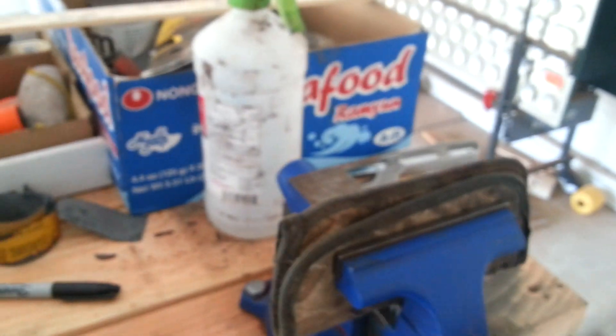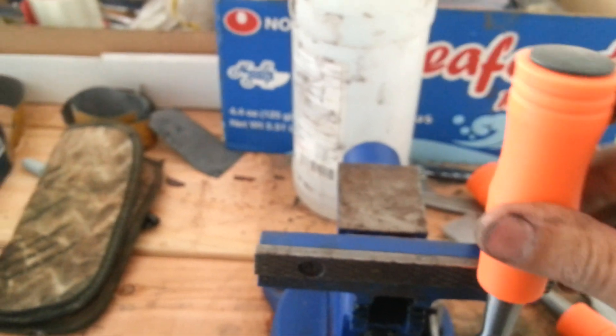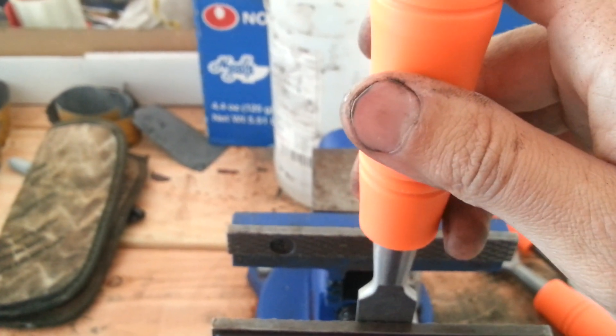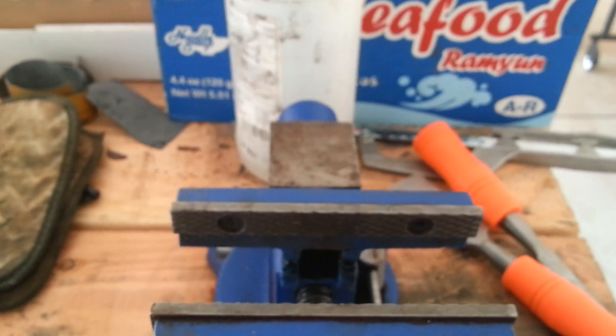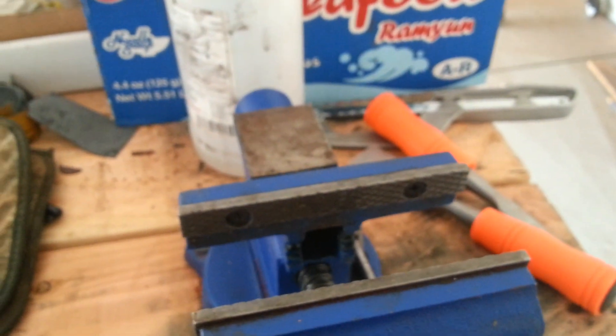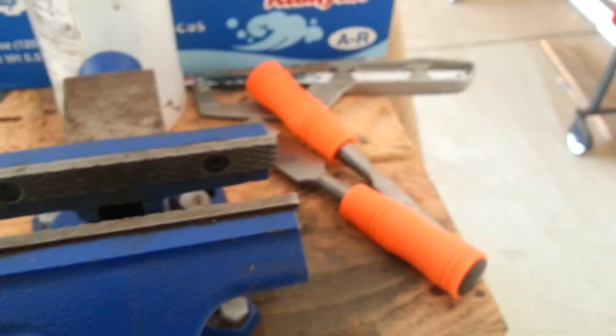So here's my bench vise. What you do is use three dowels — one here, one here, and one here. Just your bench vise, and you run your blade through it. Based on where you suspect the bend to be — let's say you have a bend like this — you place one dowel on each side and one on the opposite side to counteract it. You just tighten the vise to counteract the bend. You want to over-travel slightly — bend it a little the other way, pull it back, and then test it again on a flat surface. That'll basically do it.